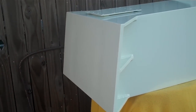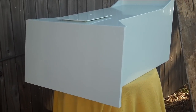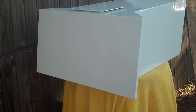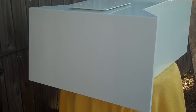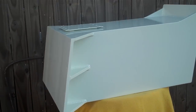But this one is so nice because it eliminates so much difficulty in mounting this directly over the hole after you have your hole filled in and fiberglassed in, because this reaches out so far beyond the hole on either side that it allows you to cover that hole and put the stresses out away from the original opening where your inboard-outboard outdrive protruded from the vessel.